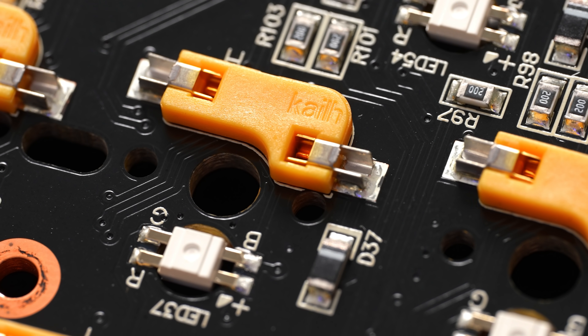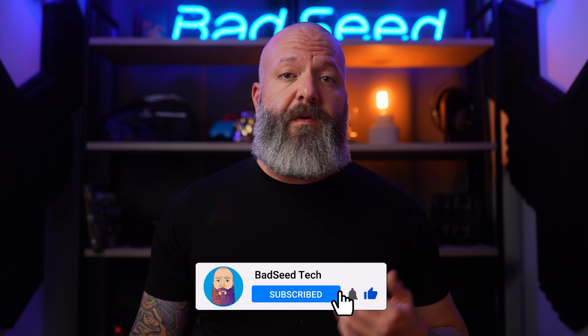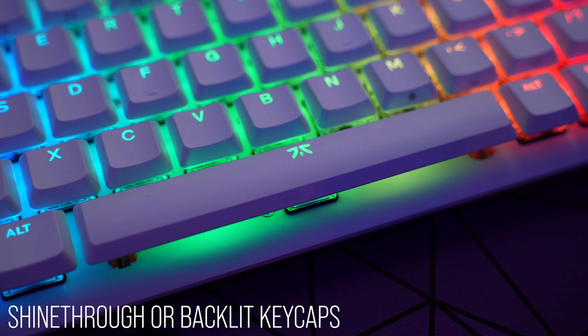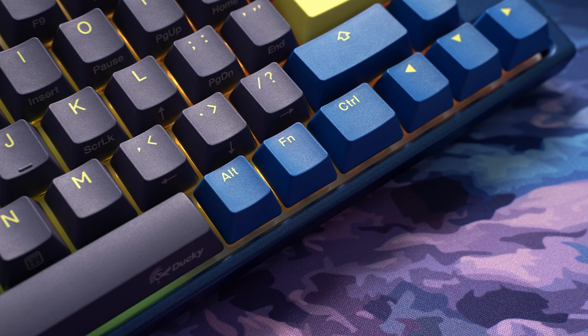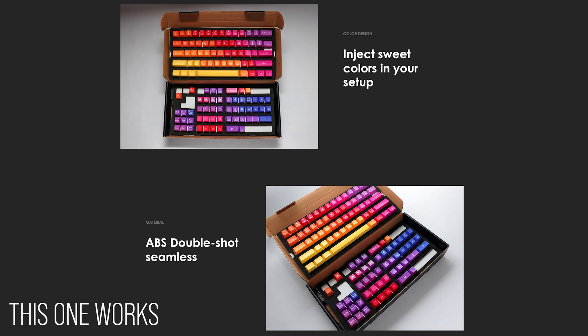These sockets are teal-colored this time, which I don't think I've seen before. These are north-facing LEDs, which you don't see too often anymore, and I think this is a move Ducky made for mass appeal. South-facing sockets are generally preferred by the enthusiast crowd, because certain switches interact with GMK, Cherry, or OEM profile keycaps where the keycap actually hits the top of the switch housing before it depresses all the way — that's called interference. The downside to south-facing is that they don't support the vast majority of shine-through caps, and even though this board doesn't come with shine-through keycaps, there's still a large market of people who would buy those aftermarket. When shopping for the SF version specifically, you have two single-U mods to the right of the spacebar and a two-unit right shift, which limits your aftermarket choices to GMK, EPBT, some Taihao kits, and not all of even Ducky's own sets. The SF is the only version with this issue.